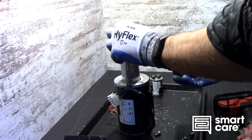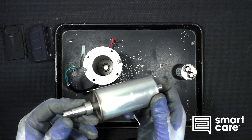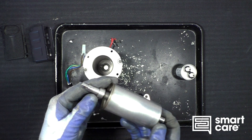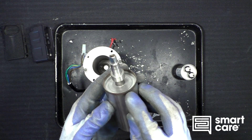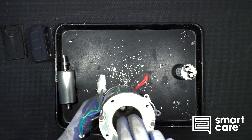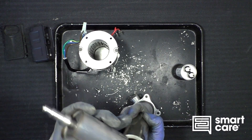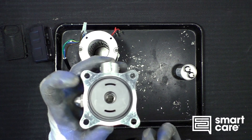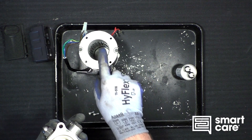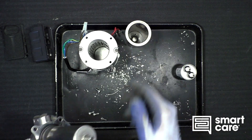We've got the rotor assembly from the inside of the motor. It's all one continuous piece and it's bushed — there's no bearing that I can see. It's totally enclosed and sealed and welded. Another sign that it's in a wet environment: the windings are all isolated from electricity using this big sleeve. There's a seal here that looks like an O-ring. This assembly would key in so there's never a way for water to get back to our electrical winding.